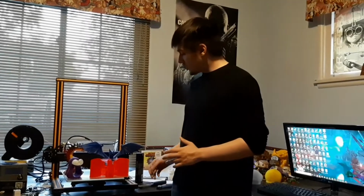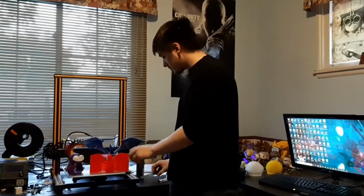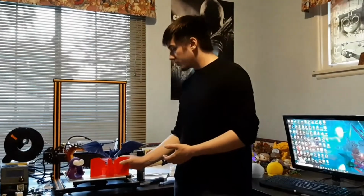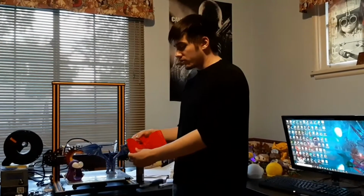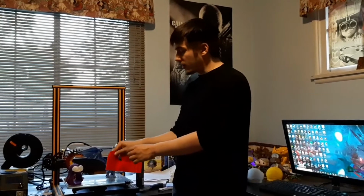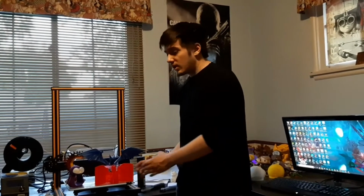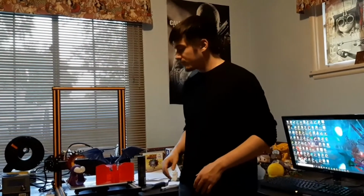When it's done, you'll wait for the printer to cool down and take your chisel to pop the print off the bed. Once that's done, you'll take your sandpaper and some tweezers. Now you'll take the tweezers in order to remove these supports. Supports are made when there's an overhang or when the print cannot directly go up. These are supposed to be removed and are just tossed away.